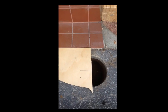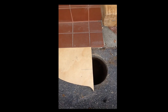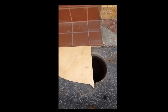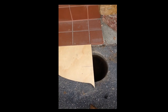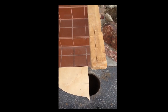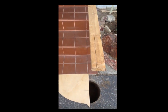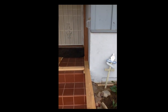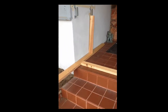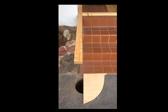I'm going to add another dimension that brings me out to two and a half inches total — that's going to be the face of the pipe — and from there I'm going to plumb down on my proper distance. I've got the line on the plywood on both sides, and that is the face of the pipe. The pipe will be on this side coming away from the steps, and that one-inch mark will be there for the pipe. Everything is braced sufficiently and when I'm done setting the pipe, we'll be back.